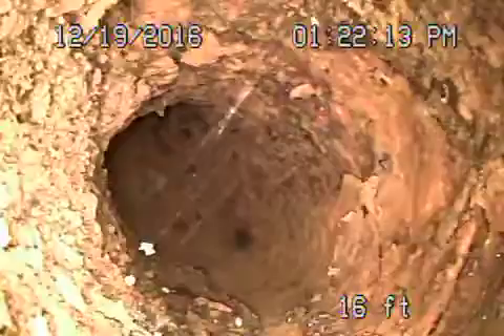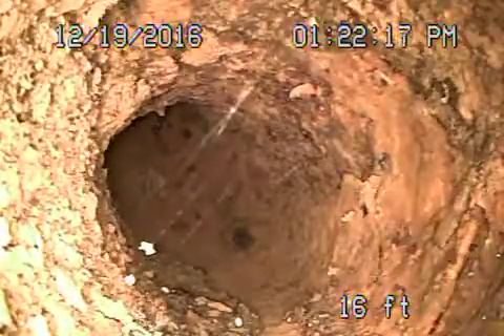There's another little piece of ABS pipe right here, and then it comes out of the clean out — there's a two-way clean out over here. Going upstream, also cast iron. I'm definitely going to recommend that you don't flush tampons, baby wipes, paper towels, etc. Got a little bit of rust buildup, not too bad. Then it comes to the end of the line, where it branches off — that's probably going to go up to a vent. That's the end of the line as far as running the camera, here in the front of the house.